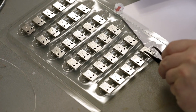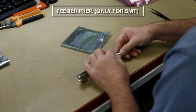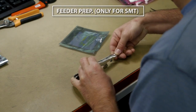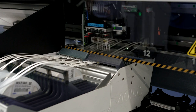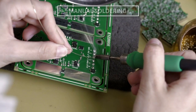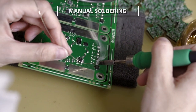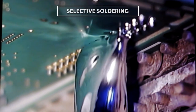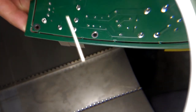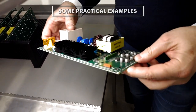You could think that THT, or through-hole technology, is now outdated and avoided where possible, as SMT is more efficient, cost-effective, and adapted to denser board designs. However, THT offers specific benefits that keep it relevant. The bonds created between THT components and the board are far stronger than SMT bonds, making THT the ideal choice for components that will undergo mechanical and environmental stress or high heat.